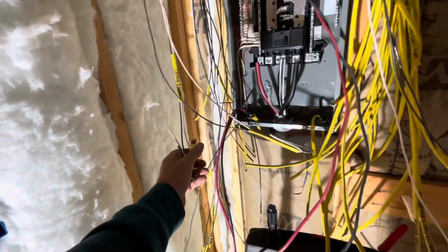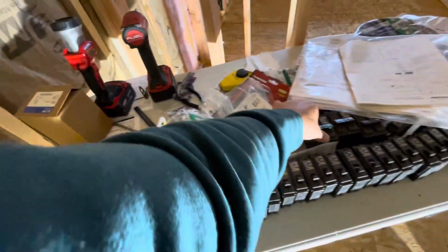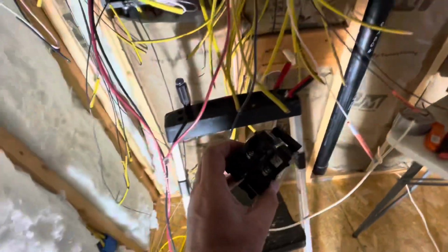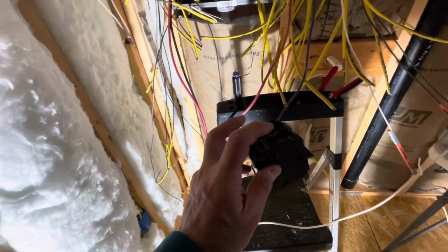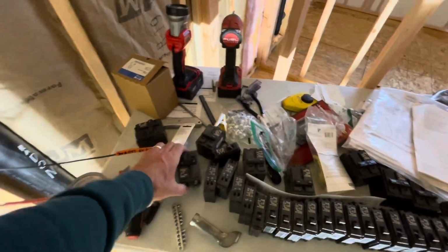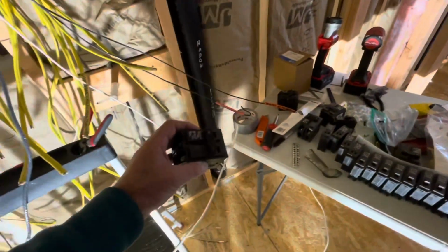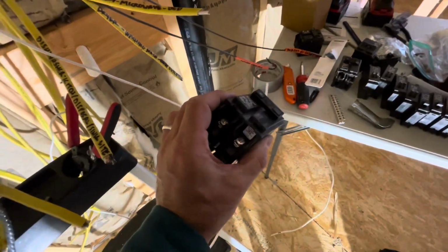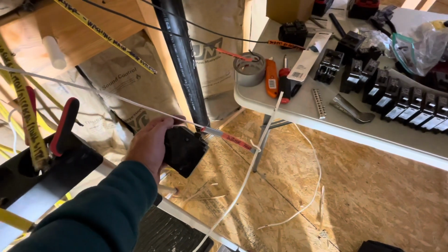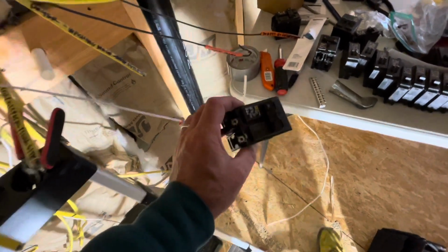And then also, just like my Cove heaters, the Cove heaters are a double pole 20, and it'll take a black and a white instead of running your neutral to the bar. And that's on 12-2 wire. And then the same thing on the hot water heater. It's a 30 amp double pole breaker, 10-2 wire, and you have a black and a white on there.